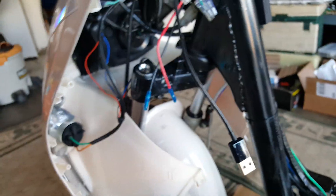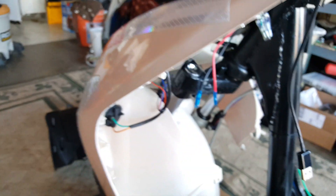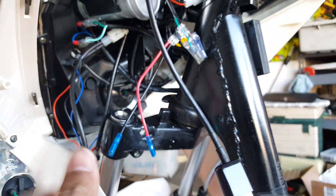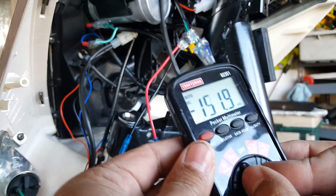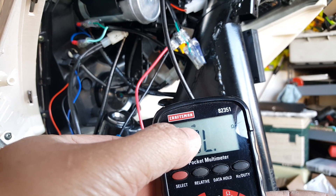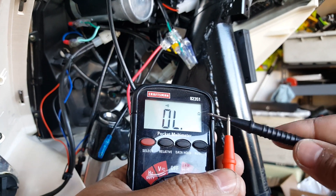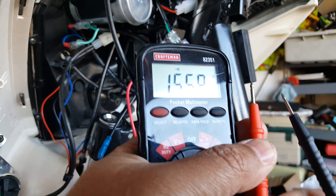As soon as this thing stops being a bobble head — I know why it's being a bobble head: I haven't really screwed it in. Let me tighten the base of it. So this is going to be near me, holding in my pocket. What we're going to do is test for continuity. You want to set your meter to ohms, and there's probably a little push button — you want to make a beeping noise. That little audio indicator is all you want. It's open load right now, but as soon as these leads touch together, this should be a short — see there. And that's what you want.